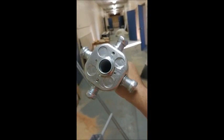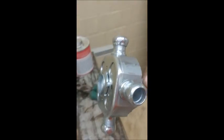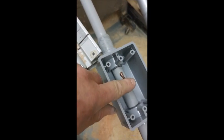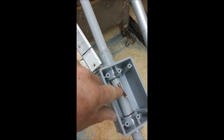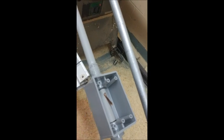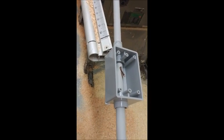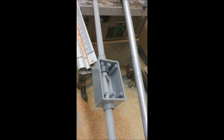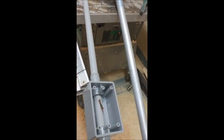I think this is going to work pretty good. It's going to be tomorrow before I can get done, but I'll be back with my coax and get it all soldered up, and we'll do some calibrations on it. If I need to tune it, I can just desolder and nip off a little at a time to tune it up. It's 103 inches — I know it won't need to be any longer than that, but I may need to make it a quarter inch or half inch shorter. I'll know when I start calibrating it, and once I tune it, it's going to be a done deal — just mounted.